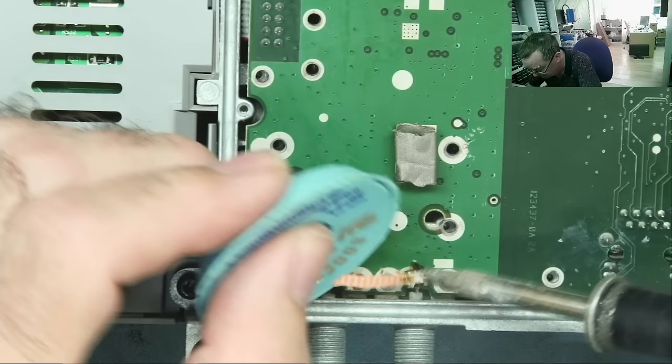Okay, well, we can just start off with it being an op amp, and let's try and measure some voltages around here, I think. Clearly, we don't have anything to go by at the moment. I'll check the power rails coming off this power supply. I don't know what this should be, but I'm interested to see if all the pins at least do have some sort of power on them. This is powering up, so you'd expect the power rails to be there, unless maybe there's a different power rail that goes to that RF circuit at the end. I'm not convinced that would be the case, but lack of anything else to go by, let's have a look.